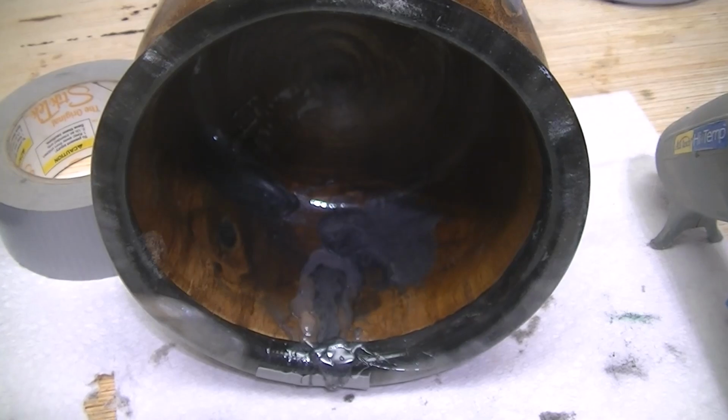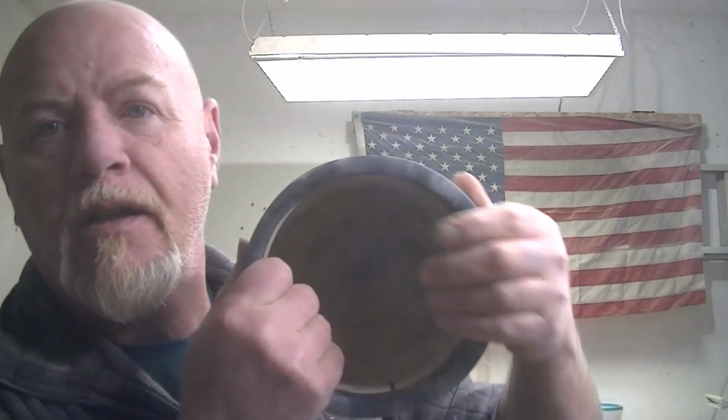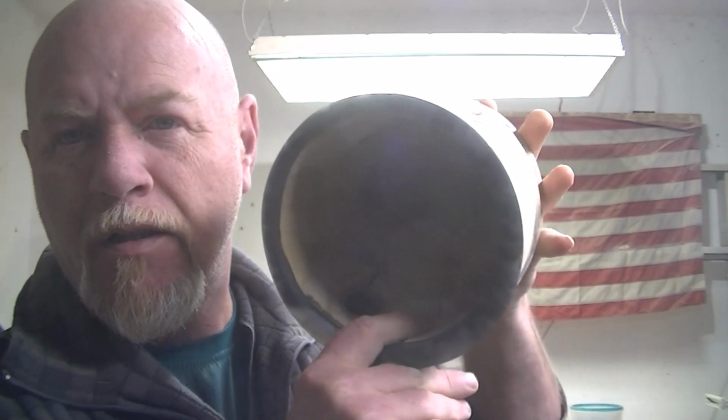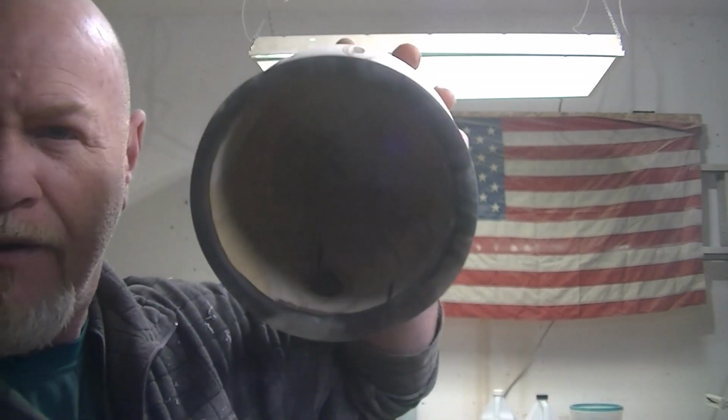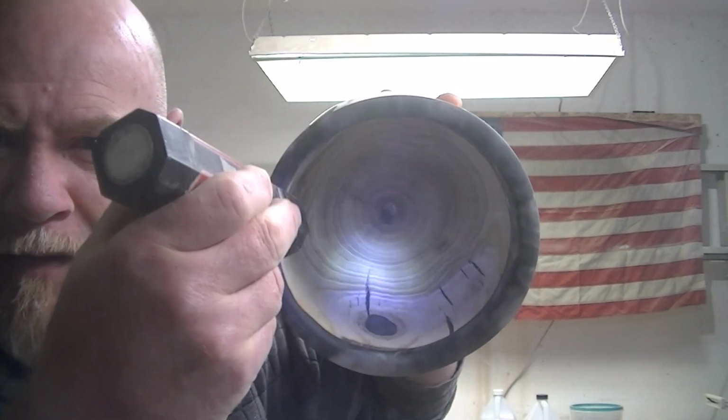Alright, well, back to the rest of it. I showed you guys before, I signed off before I was going to get the mold out, that these here had all the cracks in them. Well, they're all finally fixed. It's right there, all through here. I can't even hold this thing in my hand. I need to be a basketball player. I don't have big enough hands, but all those right there were all the cracks. I had to take everything back down to bare wood again and sand it all down, and even had to turn a little bit of it. This one here, same thing.